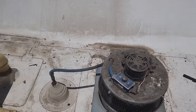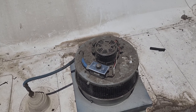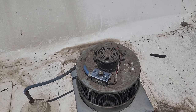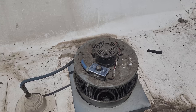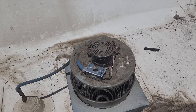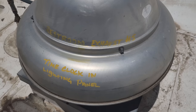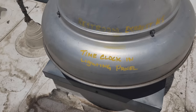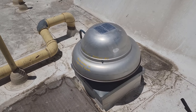I don't see any problems with the ACs. As far as the time clock goes, I'll give it a chance — it's possible it's just way out of whack because of power outages or something. I'll set it and then tell the customer to keep an eye on it. If we have to change it, we can come back another day. Last but not least, I went in and took my paint marker — restroom exhaust fan number five — and also wrote in bright yellow 'time clock' and 'lighting panel'. That way the next guy doesn't have to go climbing in the attic.